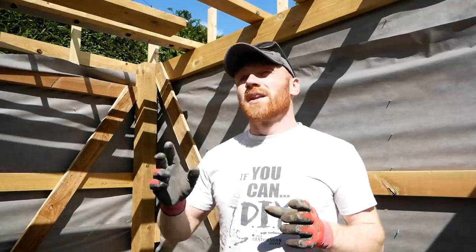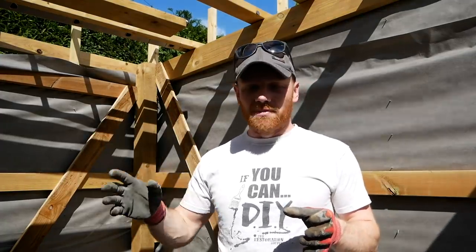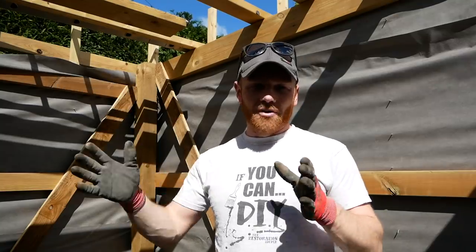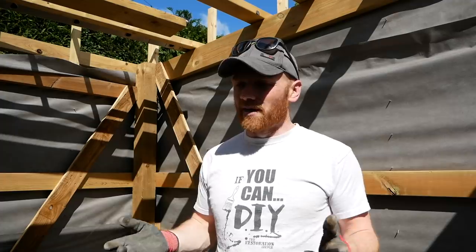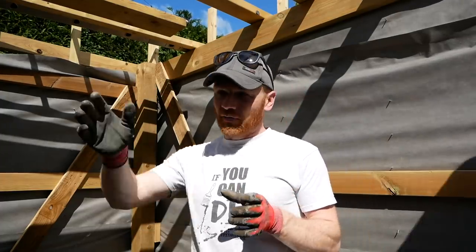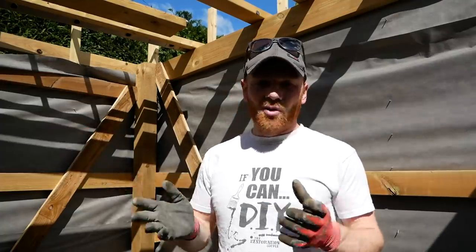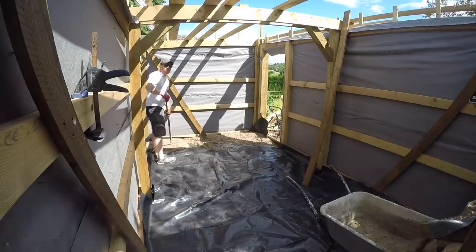Right, first mix is poured now, and we went a little bit big for that first mix, so I don't want to damage the mixer. We're going to scale that back. We're still keeping the same ratio, so it's pretty much 6-1, which is kind of a standard slab mix, or 5.5-1, 6-1. And we're making it loose enough that it'll shoot down okay, but of course the wetter you make concrete, the weaker it can get. So it's just about right what we've got now.